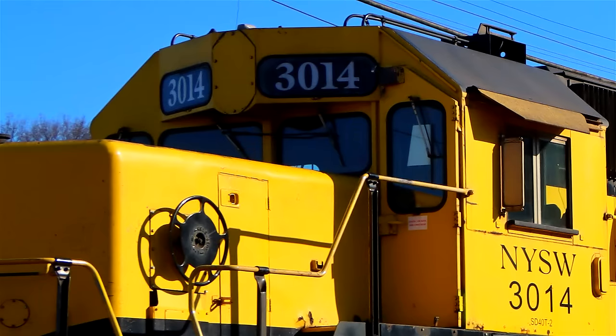A few months back, I did a video on the last tunnel motor locomotive on the New York, Susquehanna and Western. Number 3014 is an ex-Southern Pacific unit and also has the snoot nose. Here's a snippet from that video. On the SP, the snoots were used to house Locotrol and/or radio control equipment that was used in mid and/or rear end train helper service. The access door on the conductor side of this snoot most likely gave entry to that radio control equipment.